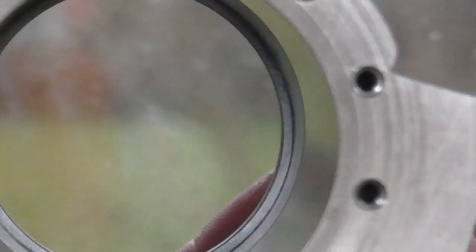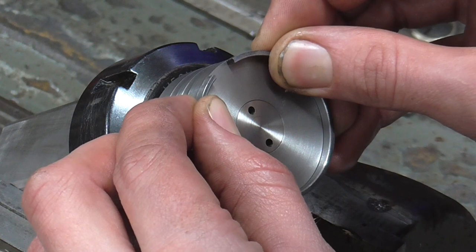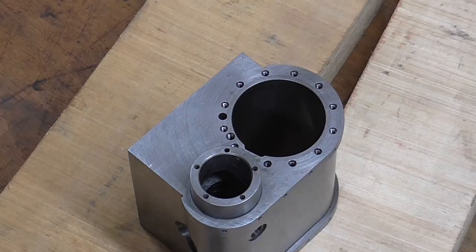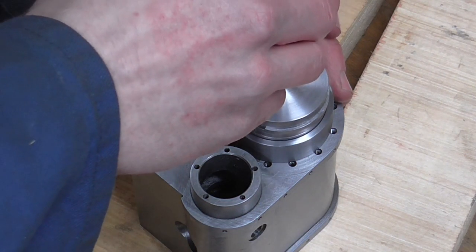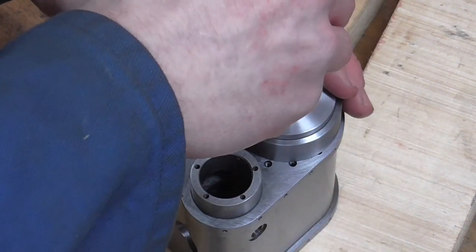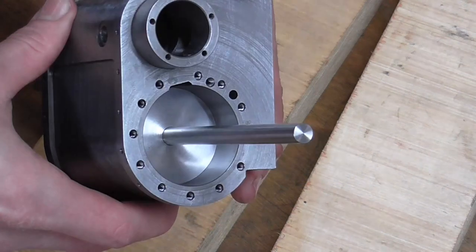Manual deburring, washing the parts in paraffin and rechecking the fit — much better. On to fitting of the piston rings — a nervous moment — but with a bit of encouragement they went on. There I have a piston with associated rings. The sleeve was used for a secondary purpose to guide them on; that sleeve is actually slightly above the bore diameter, which meant I had something to play with on those piston rings when it came to machining them, so I was able to machine the piston ring down to its running size. The piston goes in — there it is — and up and down it goes, a nice fit and all around a satisfactory outcome after what had been a bit of difficulty with those rings.